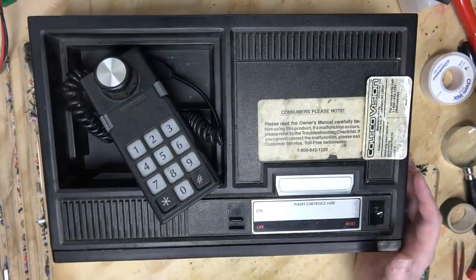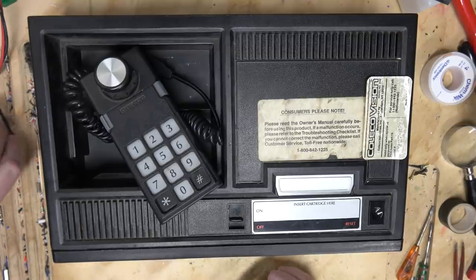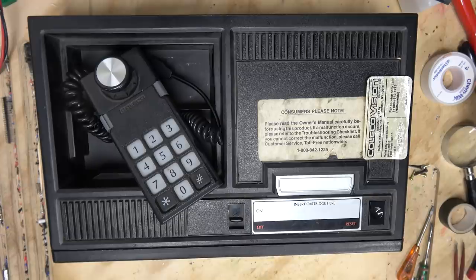The reason I wanted this is because many years ago I did a ColecoVision portable, but I did a really poor job of it — I was not happy with how that turned out. One of the big problems was the video RAM, well RAM in general, requiring a negative voltage, which I didn't know much about at the time. So I thought maybe someday I could redeem myself with that project.